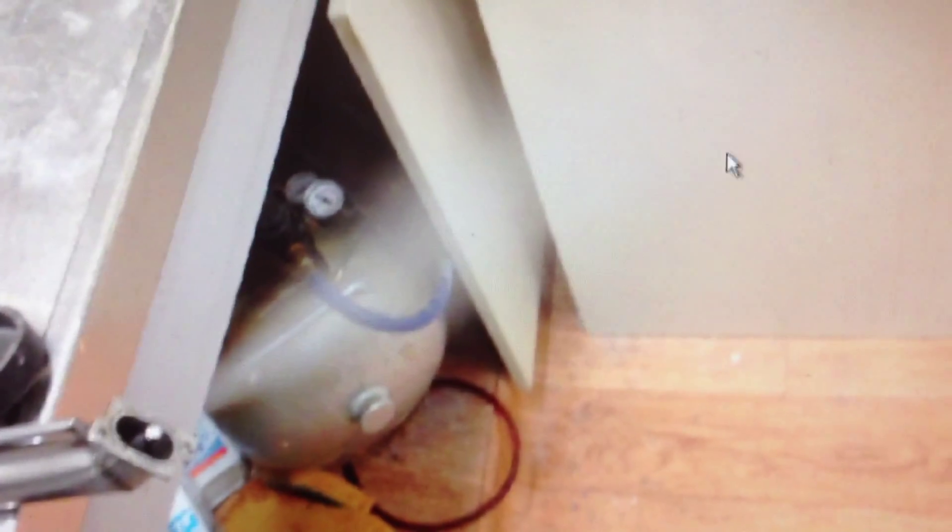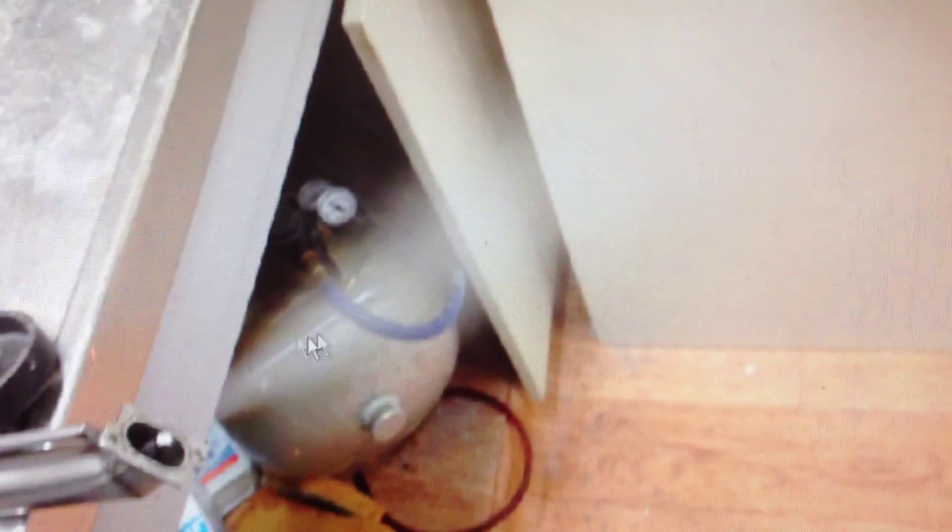Passing steam now — there's a lot of pressure there. There's 4 bar pressure of steam, which is about 50 or 60 psi or something like that. But the resulting steam trail is about 4 foot long. So the nozzle can move a substantial amount of gas provided there's the pressure.